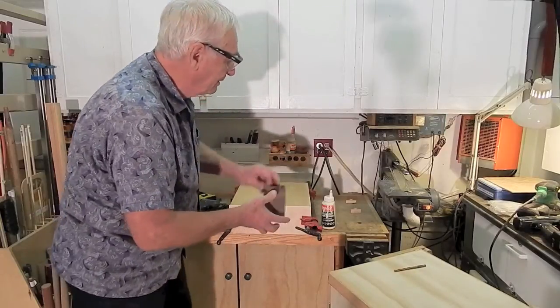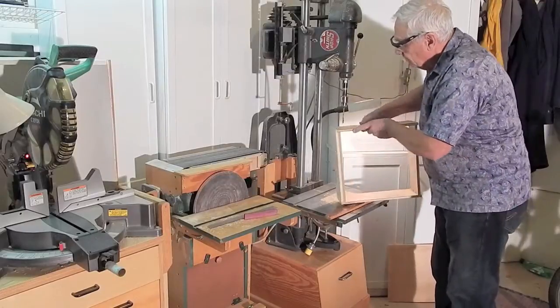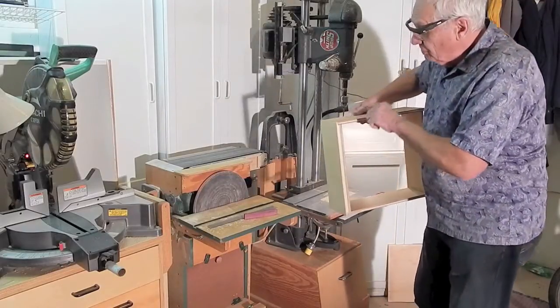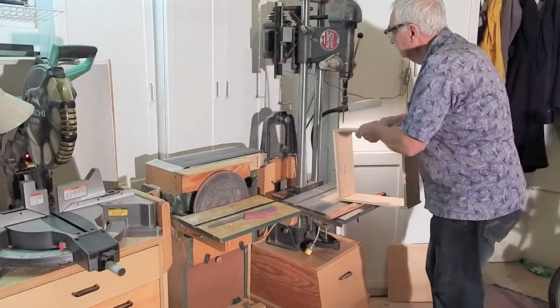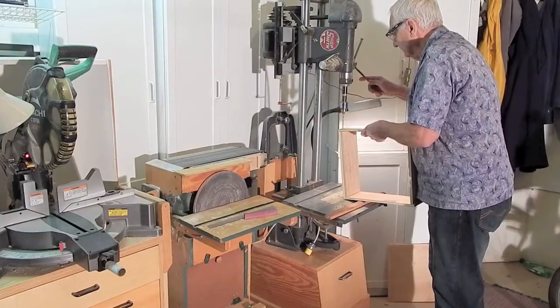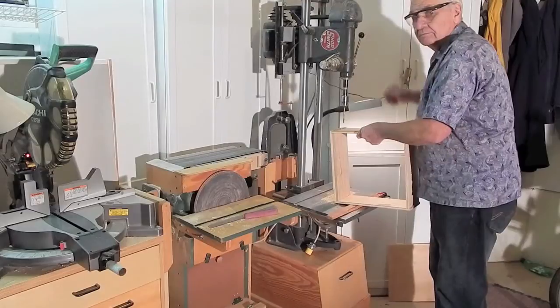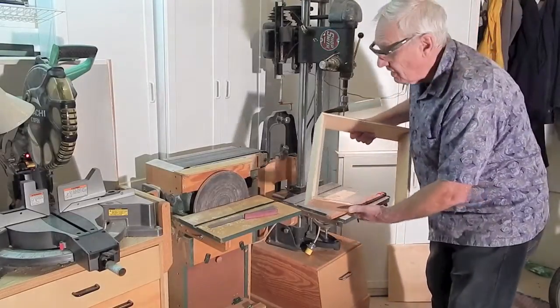And if I set the flooring in the conventional way, the drawer is not going to be deep enough for that. I'm going to drill in 4 dowels into each side to reinforce the joint between the sides and the front. Four on each side.